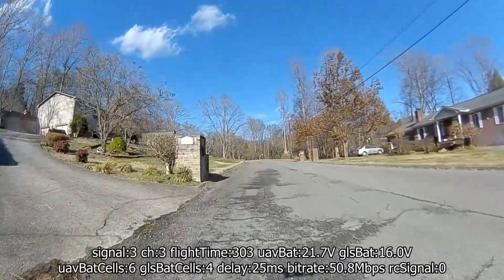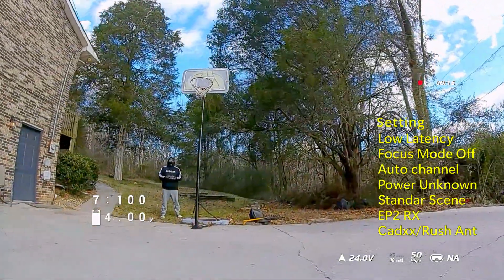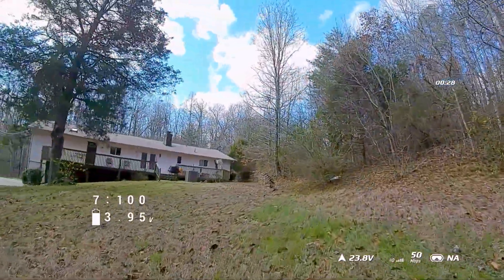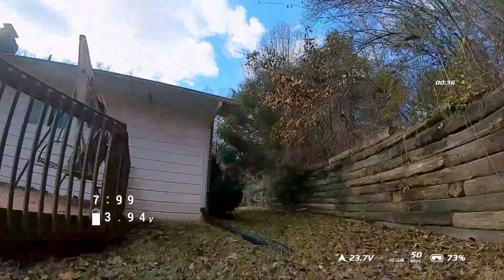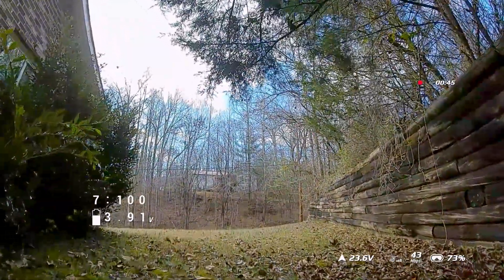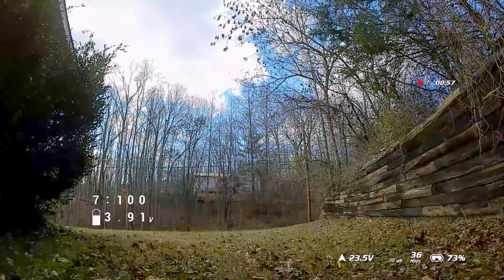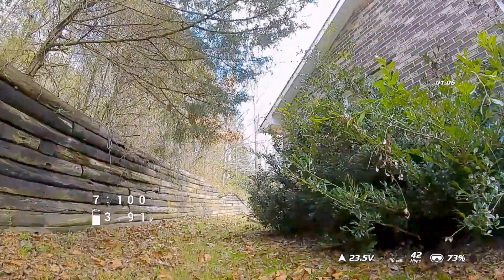Bitrate's back to 50.8, signal back to three and four — pretty good. Now we're gonna go for a second flight. This is the Geek 5 with the Vista running O3 firmware, using my Goggle 2. The big thing about it — you see a 'non-applicable' reading, which I think is supposed to be the transmission between the Goggle and the drone or VTX. It's showing 73, but I'm not really sure about that number — it seems pretty iffy to me because it doesn't really change the bitrate. The big thing about the new firmware is you don't have any control over the power you're using — it's supposed to be dynamic power, all managed by the Goggle and the VTX.